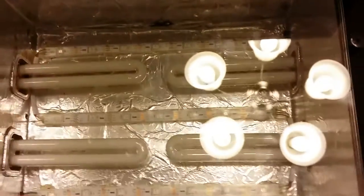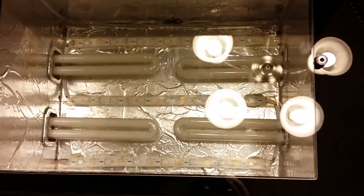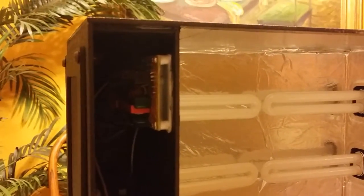These are nine watts apiece, with a total of 36 watts on the top and 36 watts on the bottom. There are also some LEDs in there that allow you to use the box as a shadow box for aligning your transparencies for your board. On the top side I have the ballast circuit board for the top lights, and on the bottom is the ballast for the bottom one.